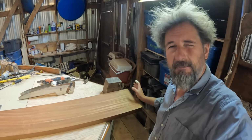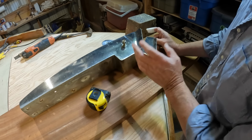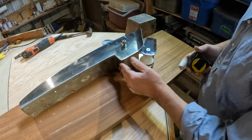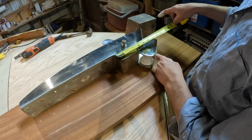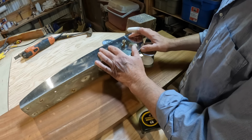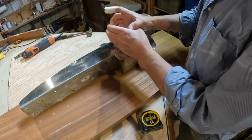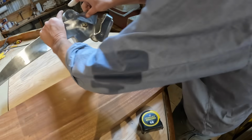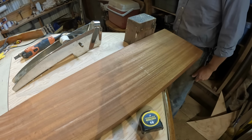I'm going to edge a little bit further out just to be safe, and I'll tell you why. That's that this janky stainless steel folding bow roller, which actually works the biz, I've said before, from the face of the wood bowsprit to where the first roller is, let's say is roughly 5.5 to 6 inches. Now, if I was ever to find a beautiful bronze bow roller, which probably wouldn't do with a tippy flippy, but that's okay, the roller is likely to be much closer in to where the end of the bowsprit would be. So I think I will make sure that I err on the slightly too long here, and we'll call it about there.